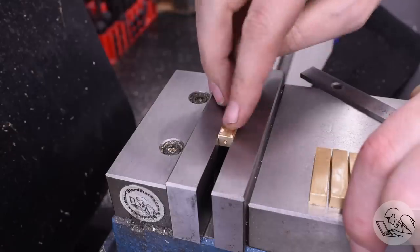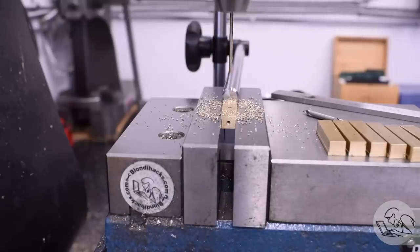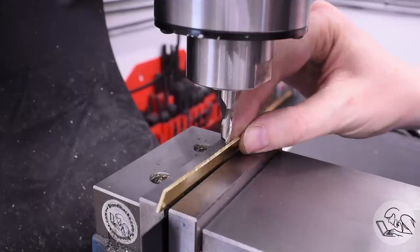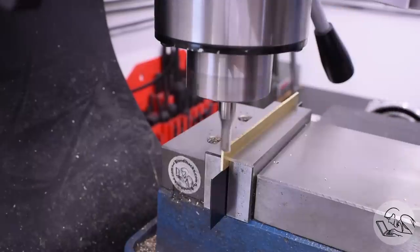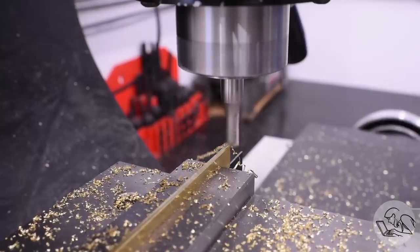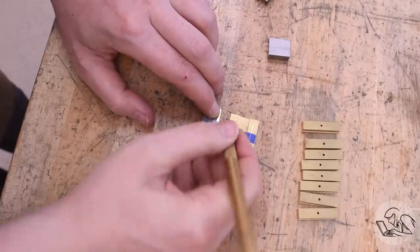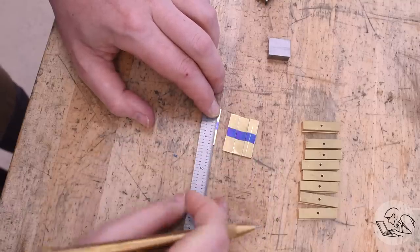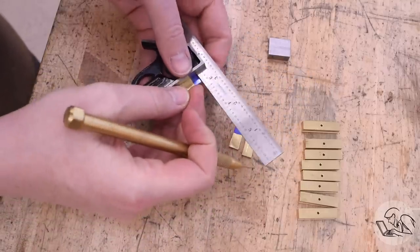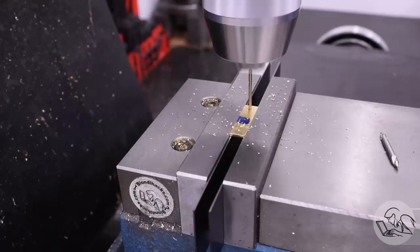The final feature is a side hole used for fixturing the part to that block we made at the top of the show. I don't think this hole serves any other purpose — it could be an oil hole, but I think it's mainly just for fixturing. I've cut a strip of brass off a larger sheet to make the little cross bars that form the arch shape of each structure. I'm making them in a batch of all four, machining the brass strip down to the proper width and cleaning up the edges, then rough cutting them apart. The ends only need to be rough cut because we'll be filing them to a precise fit. I rough-marked the center of each as a reference for bolt spacing, since the bolt spacing is important but the length of the parts is not.